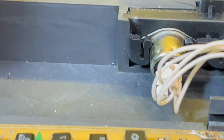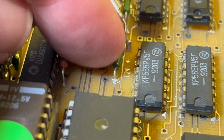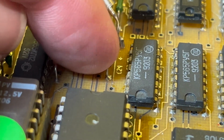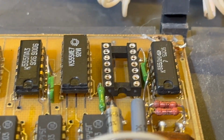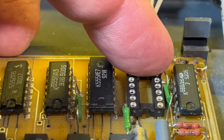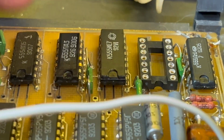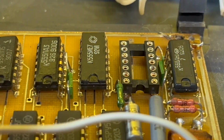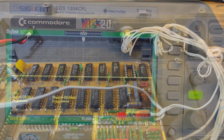One thing I read is that when you're using CMOS, don't have a pull-up resistor. So I might disconnect that and see what happens. I checked the voltage here. It was 4.9 volts before, which seems to be pretty much what I'm putting in, but the output's coming at 4 volts, so something's disappearing. I thought maybe it's just not generating. Anyway, let's see.